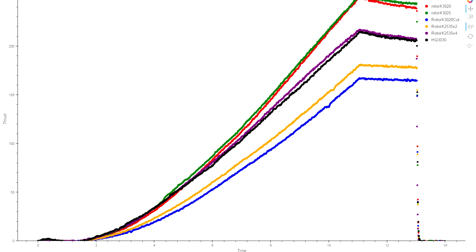The motor I'm testing with is the RCX 4000kv 1105, so it's not an exact one-to-one. The 1304 motor does have higher kv, so we expect it's going to make more peak power, but we should still be able to infer something just from the rough classes. Once we get into the numbers, it's pretty clear to see where the class lines fall between these two motors, despite the slightly different performance we expect.